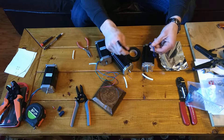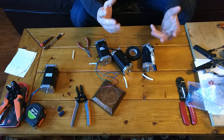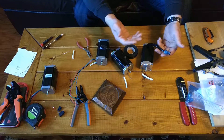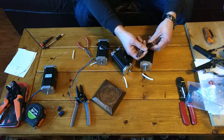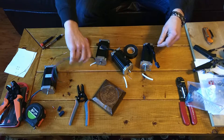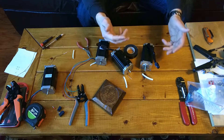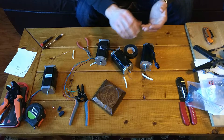Once I have my plug crimped on, I like to wrap the wires together into one package, but I don't just wrap it straight in electrical tape. What I prefer to do is first wrap it in some foil and then wrap it in some tape. This accomplishes a few things. For one, it adds some bulk — just like the string in the other cable we saw, it just makes the whole bundle a bit more substantial. And in my opinion, delicate things just don't belong in the shop, so bulk is good. Secondly, it makes the whole bundle a bit more rigid, so if you bend it in a position, it'll stay in roughly that position. Compare that to the pigtails here with these stranded wires that kind of just pull back every time and don't really take a shape when you bend them — this is possibly easier to route.